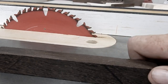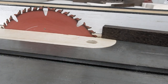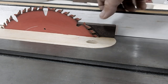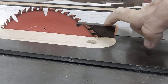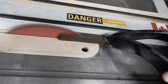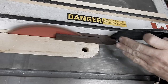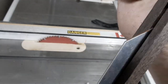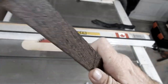I want to cut a slot in this block and it has to be cut at a 45 degree angle. What I've done is raise the blade to this height and that'll give me a rough cut at that mark. I'll make a mark on my fence with an orange sharpie and that'll tell me how far I can push this block. If we check it with the large bevel gauge we can see that that is a pretty good fit.